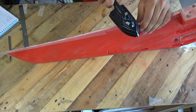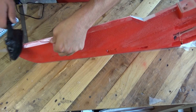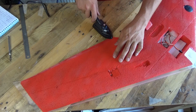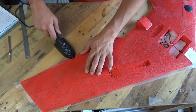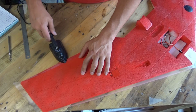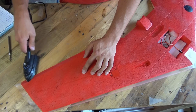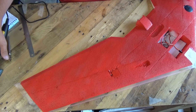So unlike before, where we put a cut in this, I'm going to do this one all in one go. Just going to bend, hold that up, fingers are away from the iron, like so. Brilliant, just going to fold that over the edge, get this down. And I was going to fast forward this, but screw it. Just want to show you the kind of pace which you can work at, especially, again, this iron's a little bit hotter. I've gone up to medium and a quarter on there, so about 2 o'clock on the dial.